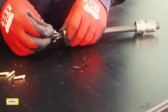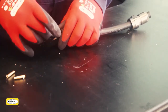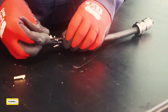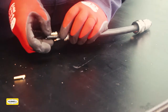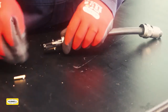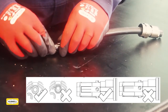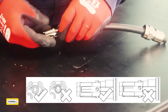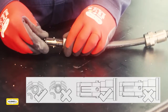Take the first contact, slide over the conductor, and press into the slot as shown. The contact will now be retained in the socket insert. Repeat for all positions. Take a moment to confirm the sockets are correctly seated. Visually confirm all contacts are concentric to the openings in the tip of the socket insert, and confirm all contacts are correctly rotated so that the grub screw is in the centre of the slot.